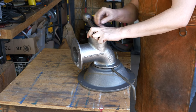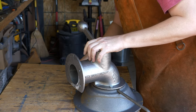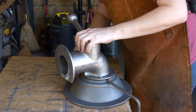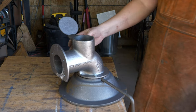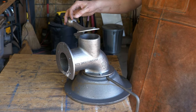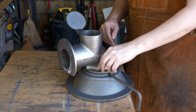I've done this backwards - I'll fix that off camera so that you can see it. The reason I orient the bolts this way is I don't want them sticking up into the bottom of the fire. The fire is going to get hot. Having bolt heads up there will give stuff a spot for clinker to hold on to in the bottom of your fire, and it can potentially melt the bottom of the bolt heads. So if we do them from the bottom, you can see they're designed to come flush right there - nice and smooth.